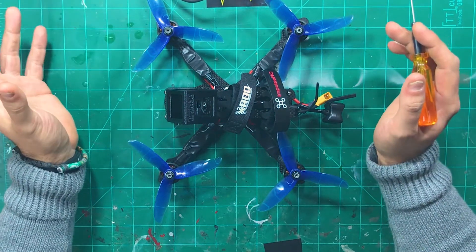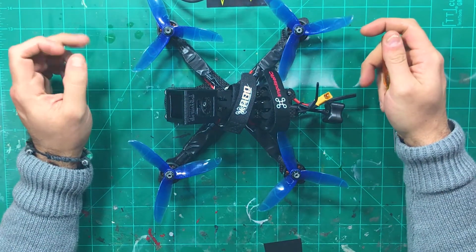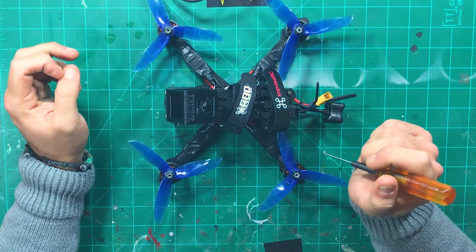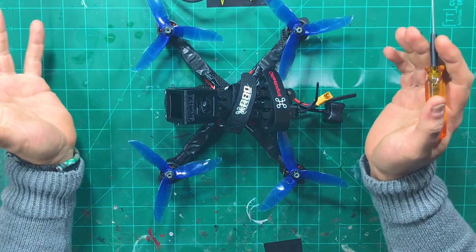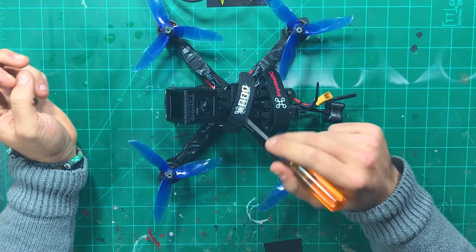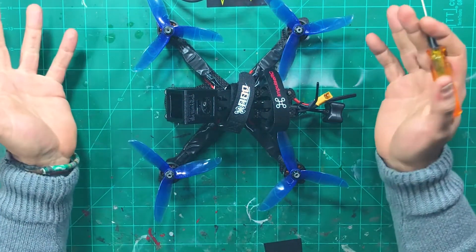I am picking up a little bit of extra noise now, which I can show you in some video whenever I get more time to fly — the polar vortex weather is just wrecking havoc for us FPV flyers. But that's something I wanted everybody to be aware of when building and soldering this up: if you're going to be running a higher power VTX — 500, 600, 800 milliwatts — for mid-range, or even if you just want to run anything greater than 200 milliwatts, you definitely want to go off of VBAT if you have a high-voltage type of video transmitter.